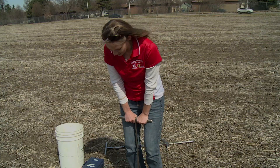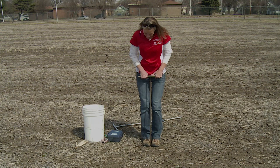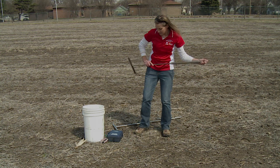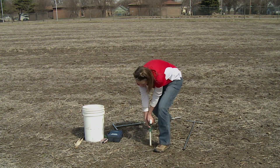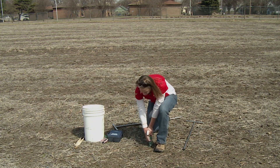When installing — whether you're doing this for irrigation scheduling during the growing season or to figure out your beginning soil moisture — basically you just use a regular soil probe. What we're using is watermark sensors, and in my case we're also connecting them to data loggers. In the off-season, we also recommend using temperature sensors as well, because these data loggers have the soil temperature set at 70 degrees, and we know we're far away from that right now in the 30s and 40s across the state. So the temperature sensor is really needed if they're going to be installing in the off-season.